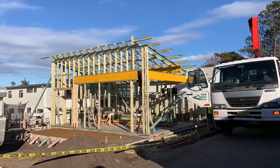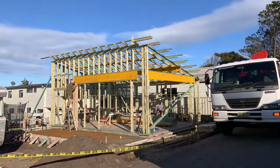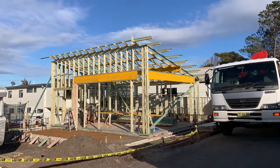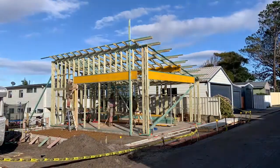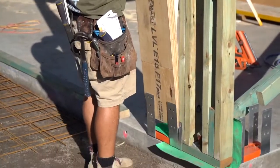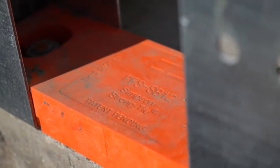What is that exactly? Well, the system provides designers, builders and contractors with an easy way to remove heavy and expensive steel braced wall systems with single and double wall timber portal frame kits. By marrying laminated LVLs with Simpson Strong-Tie's wall portal frame kit hardware, users are achieving wall bracing requirements with narrow wall widths, which is significantly quicker, cheaper and easier to install than steel brace wall systems.